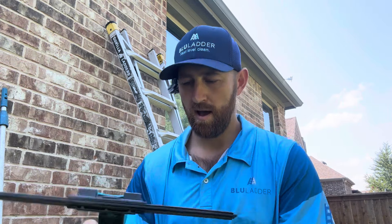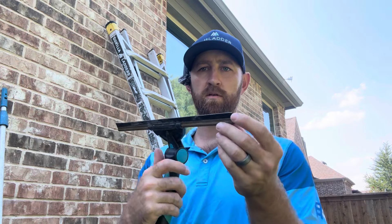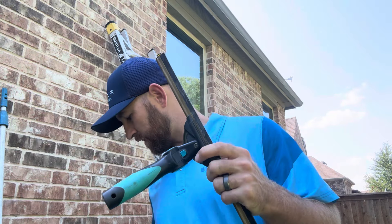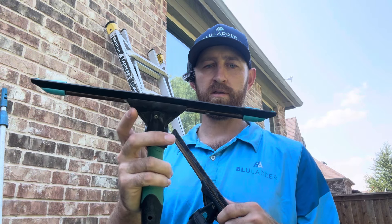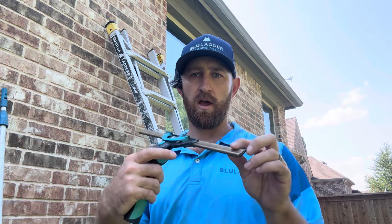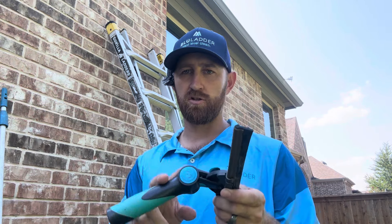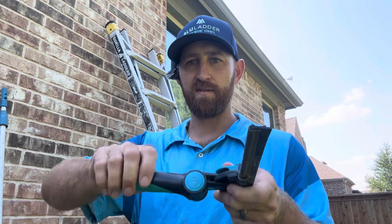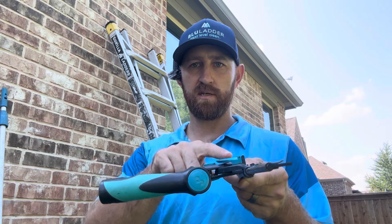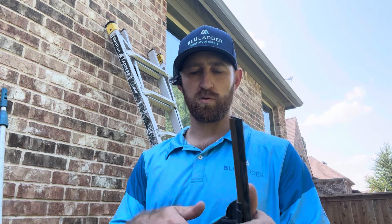The first thing you're definitely going to need is a squeegee. I have here the Moerman accelerator handle with the Moerman brass channel. I do really like the Moerman channels but they're a little more complicated as far as technique goes, so starting out you might want to stick with just a complete squeegee built exactly like this. There are two versions — the original and the 2.0 — and the main difference is one goes to about negative five degrees, which is the adjustable angle from handle to channel.